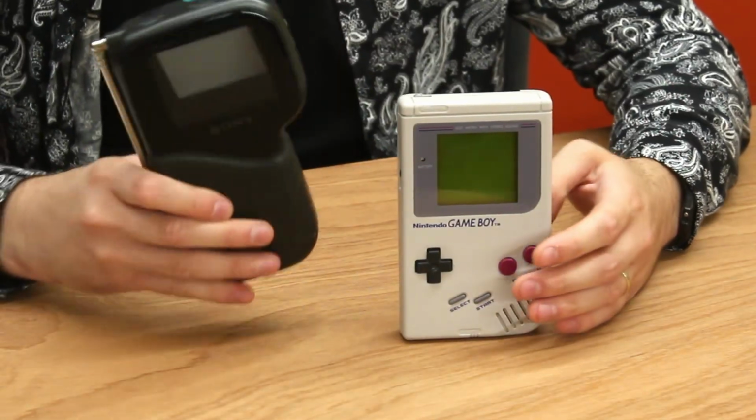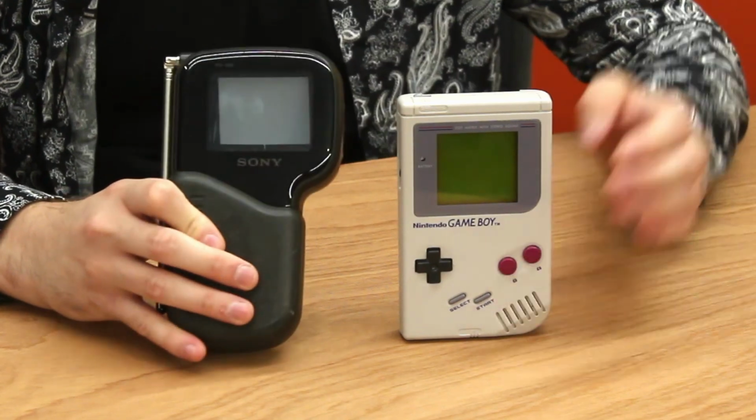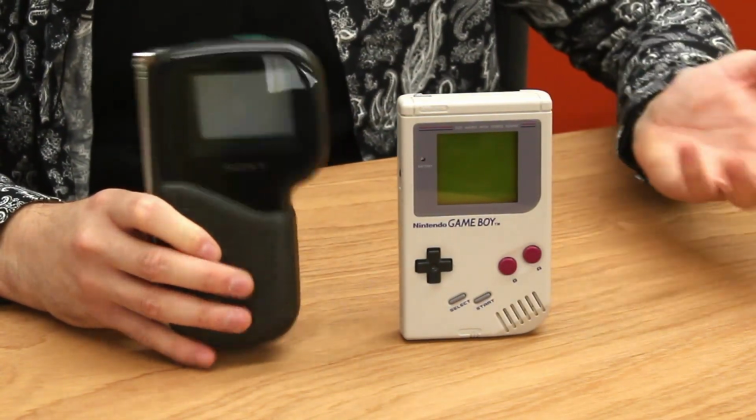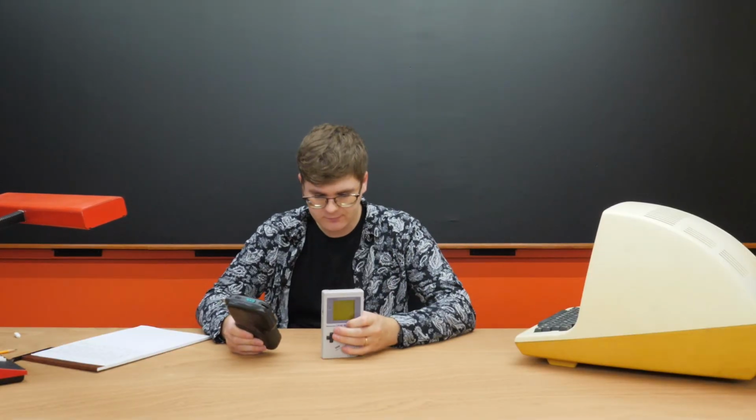Okay, hear me out. It was 1989, and there was better LCD technology than this on the market, definitely. Not even LCD stuff, like, how about a screen like this in the Sony Watchman? Sure, it's a CRT and consumes more power, but it's got a comparable display size, it's much brighter, and it has better contrast. I mean, you're only talking about like 4 shades of gray on this thing, so. Display quality wasn't really the name of the game for, well, the Game Boy.